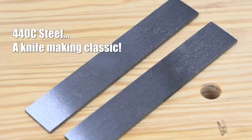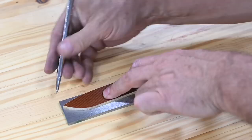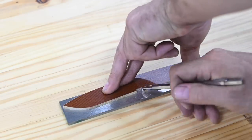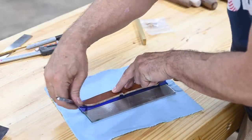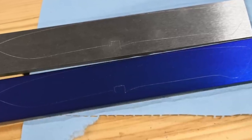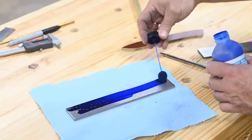The stock here will be 5/32nds, giving us plenty of thickness for authentic Loveless-style hollow ground bevels and tapered tangs. Alan at Pops Knife Supply has sent me a pattern to use, so I'll trace this onto the steel. Because this build has some features I don't typically do, I'm actually going to make two knives — one as a practice blade to screw up on, and the other to try and make more correctly. On one, I'm scribing direct to the steel, as Bob Loveless does in the book, while the other uses layout fluid — the method I prefer, but both work just fine.